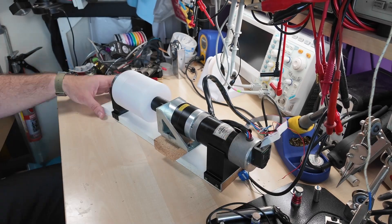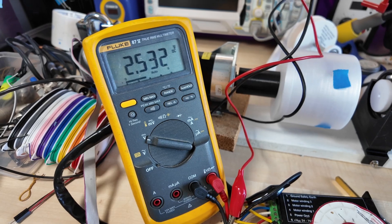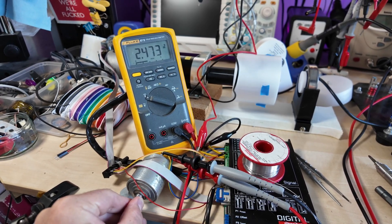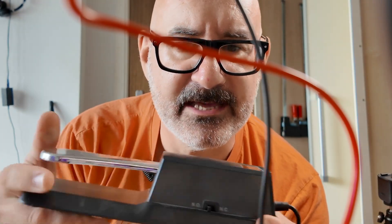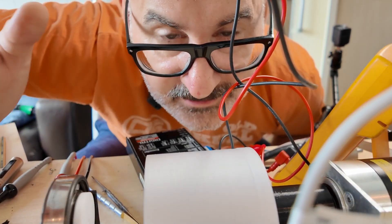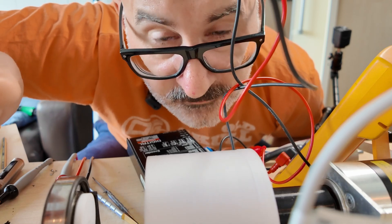Push it together and a last-minute flipperoo. Check this out — a potentiometer. I can adjust the speed by seeing the voltage coming out of it as it forms a voltage divider. I can have it do whatever I want, even super slow. I've got a pedal off an electric organ, so I'm going to connect this to this and have both hands on the wire the entire time, slowly filling the coil with wire — almost like it's an enjoyable hobby and not a sort of torture sent from hell.